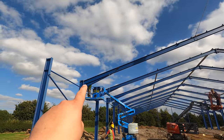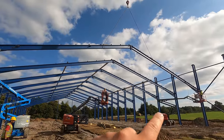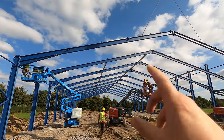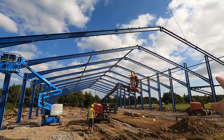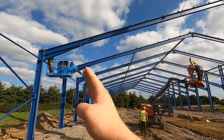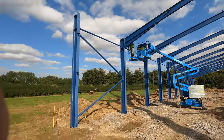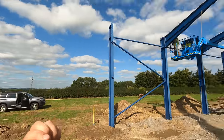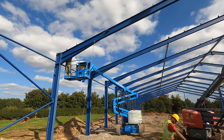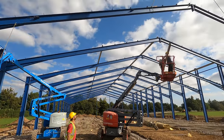He's just coming across with some timbers now. Once you get the bolts in either side that secures it, but to make sure it can't pull either way you get the timbers fastened up there as well — just put a few in to hold it to start with. You can see on each of those brackets that's where the timbers will go. Once those timbers are up, that's what they can fix the roof to and fix the skylights to, so they'll get all the roof fixed in.